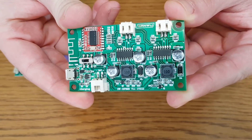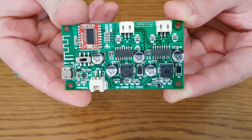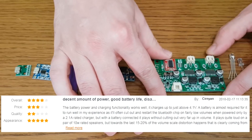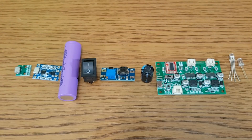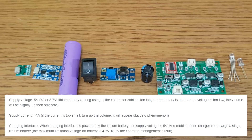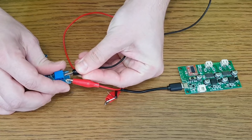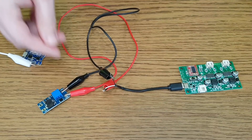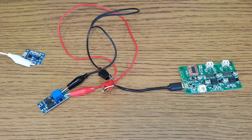But we need to specify three important things about this product. If you read the reviews, you will notice some people complaining about the Bluetooth amplifier shutting down at higher volume level. Since we have a Bluetooth module and two amplifiers in one board, you need a supply current higher than 1A, as specified in the product details. But this information is insufficient — you also need some good wires to deliver that current, otherwise the Bluetooth module will shut down when you turn up the volume.